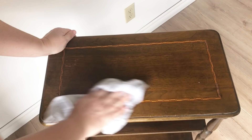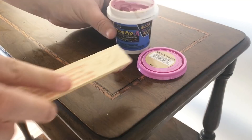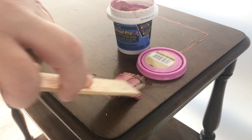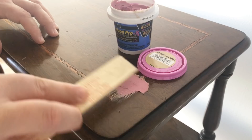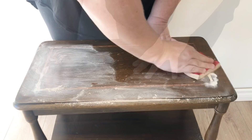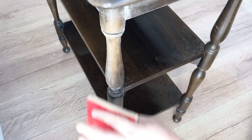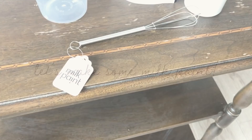There was a chunk of inlay missing on the top, so I filled that in with a little DAP wood filler and let it dry. I still want this table to show its age and character marks, so I'm not going to go too crazy trying to smooth things out — I just want to fill in that giant hole. Once it was dry, I sanded the filler smooth with a 220 grit sanding sponge, then continued over the rest of the table to scuff things up — nothing crazy, just a quick once-over to dull the shiny surface.